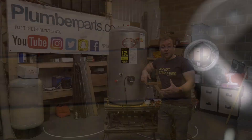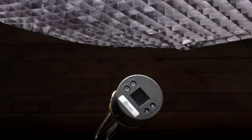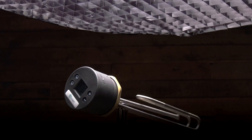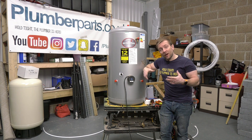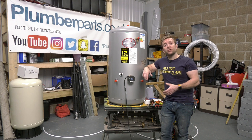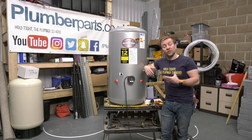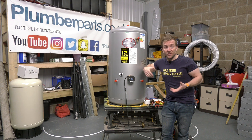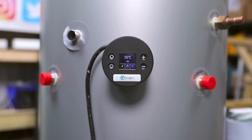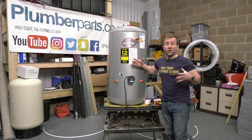There are a couple of background functions worth knowing about. First, anti-legionella: it's a built-in function that operates in the background — if the heater does not reach 60°C for 15 days in a row, the anti-legionella cycle launches automatically and the water is heated to 60°C for 30 minutes. There's also frost protection, so if the tank temperature gets low because you've gone away, it will come on and heat the tank up to prevent freezing. You can also have one app with multiple devices, which is handy for landlords with multiple properties or plumbers with multiple customers. There's also a smart function that learns from your water usage and sets up timings automatically to best suit your lifestyle.